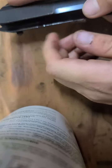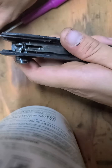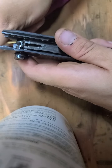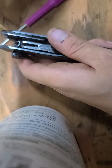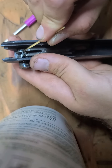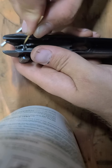It's not loose, but not as tight since I took out a couple rotations on the spring. What I like to use is toothpicks. I'll shove that toothpick in there and try to just grab that spring out. I'm just going to coax it out of there. You might have to move the safety a little bit more — be careful you don't want to move it all the way or your firing pin is going to go flying out.